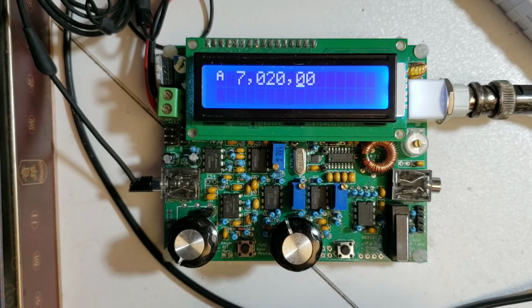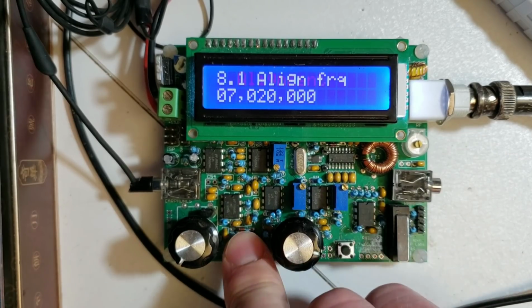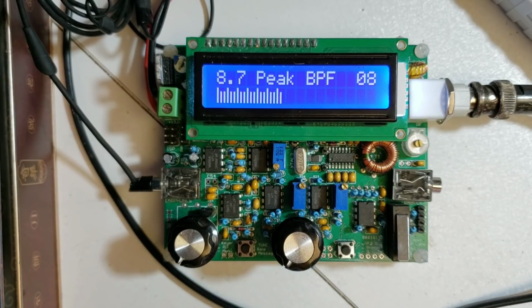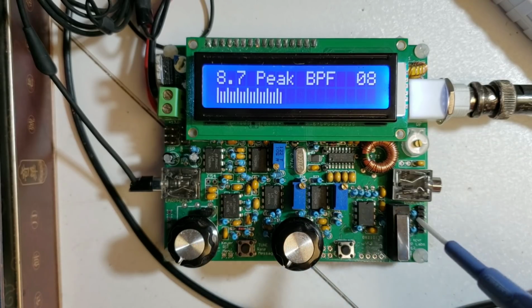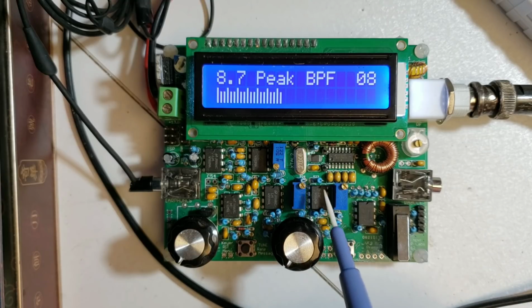The technique is to put the radio into the bandpass filter alignment mode, which injects a signal into the front end of the radio, a loud signal, in fact, loud enough that you can trace through all of the audio stages, and at some point you will find somewhere where the DC bias is wrong, or where the sine wave signal that you're expecting just disappears or is very distorted. And once you've found that point, you know exactly which op-amp has the fault.